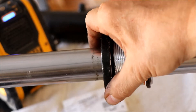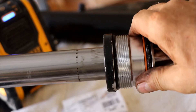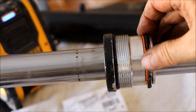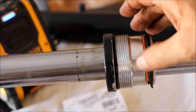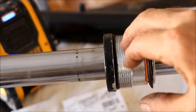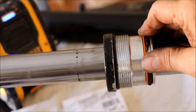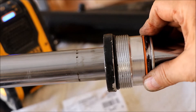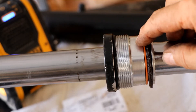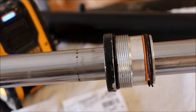This is the piece that slides back and forth on the rod - it was leaking a little bit. You can see the seals have to be replaced. This seal wasn't installed properly and got caught and wrecked as it went in. It has to be replaced and again the spacer has to be oriented towards this end. We'll slide this off and look at the seals on the inside.